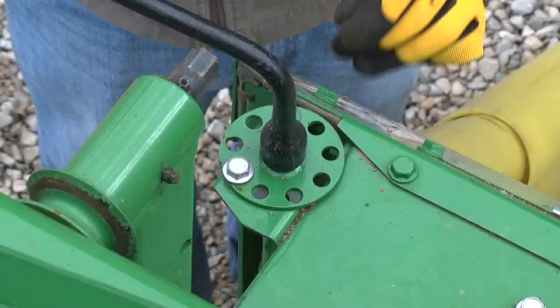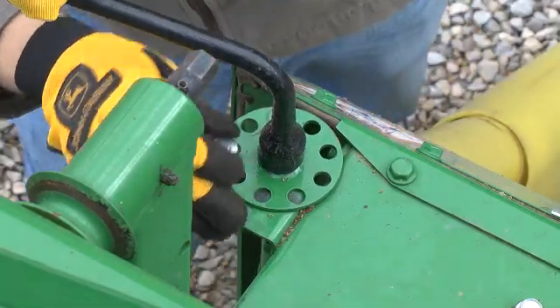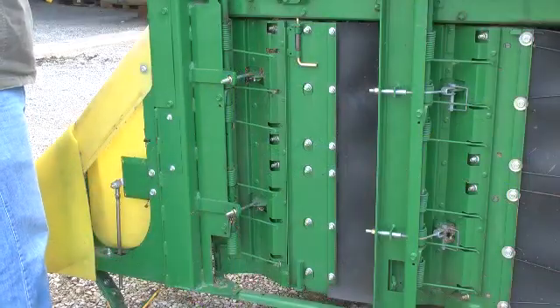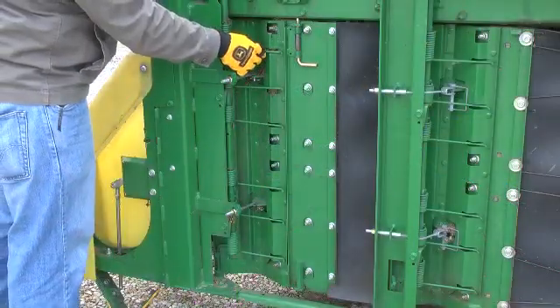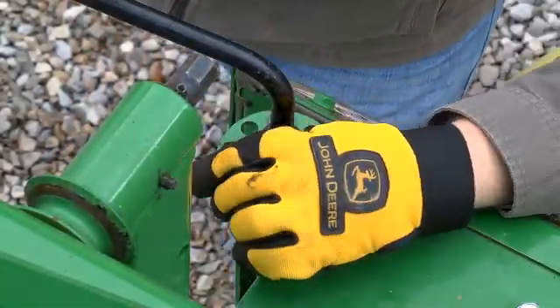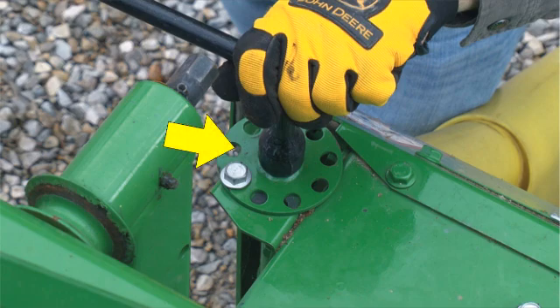To adjust pressure plate spring tension, use the row unit wrench or a 19 millimeter wrench to rotate the shaft counter-clockwise until the cap screw can be removed from the adjustment plate and tension is removed from the springs. Rotate the adjustment counter-clockwise until the springs contact the pressure plate and a hole aligns in the adjuster plates. Check to assure springs are seated in the slots in the pressure plates. Rotate the adjustment on the front drum counter-clockwise until the second set of holes align and install the cap screw. Rotate the adjustment on the rear drum counter-clockwise until the third set of holes align and install the cap screw.